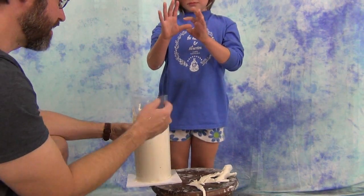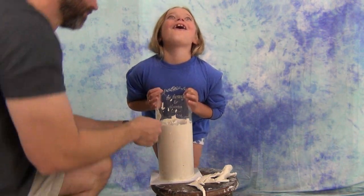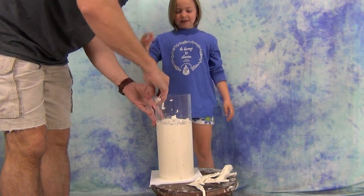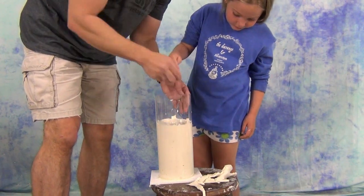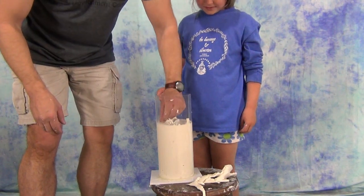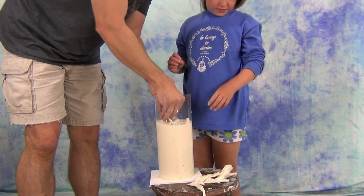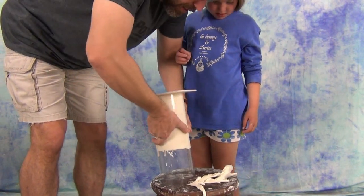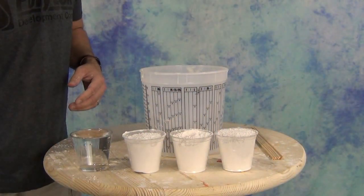There she's free and the mold is ready to cast. It's real important to make sure that any little stray bits of alginate don't fall down into the mold. Pull any stringy little bits and drips out and make sure they don't fall down into the hand. If they do, flip that mold upside down and shake it out — get all those little alginate bits out as soon as possible, because you don't want little bits of alginate debris blocking your hydrostone from getting into all of the fingers.